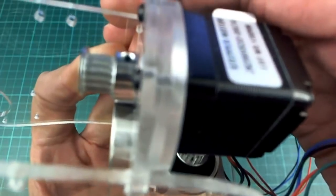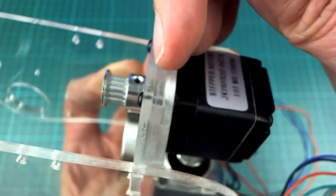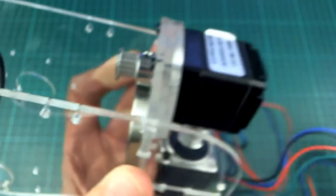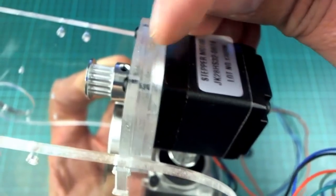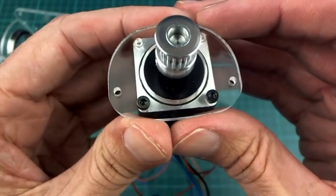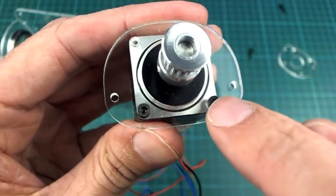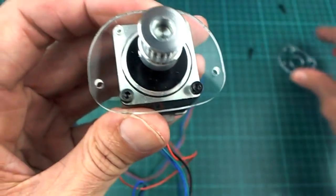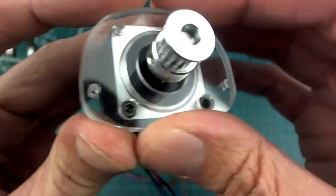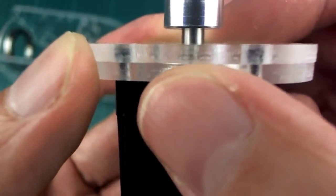So what I've had to do to get around that is I've made a couple of plates here. You can see there's two more 3mm plates there, and these bumps that I was just showing you, the bump for this screw and the bump there for that round piece, are actually living inside one of these. Let me take that off so I can show you what it's like inside. So this plate just has normal holes that are the diameter for these screws to go through, 6 of them there, nothing special, and it's going to connect the motor with just the bottom 2. The middle plate has slightly larger holes where those bottom 2 go, and it's going to go around the heads of those screws like that, so that from this angle they're not protruding, they're not getting in the way there.